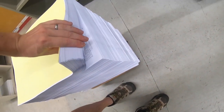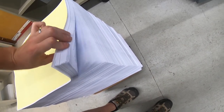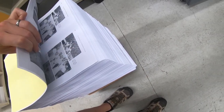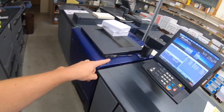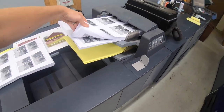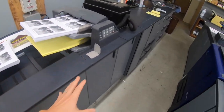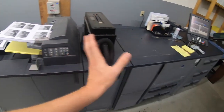It's little things like this that it's good to do if you have the opportunity. So this is a really thick book — 600 some pages — and it's pretty much all text except for the last nine pages. So what I did was I printed the last nine pages of black and white photos on here, and then I'm doing a post insert. So it'll print the text, then pull nine sheets and the slip sheet, and then keep going.